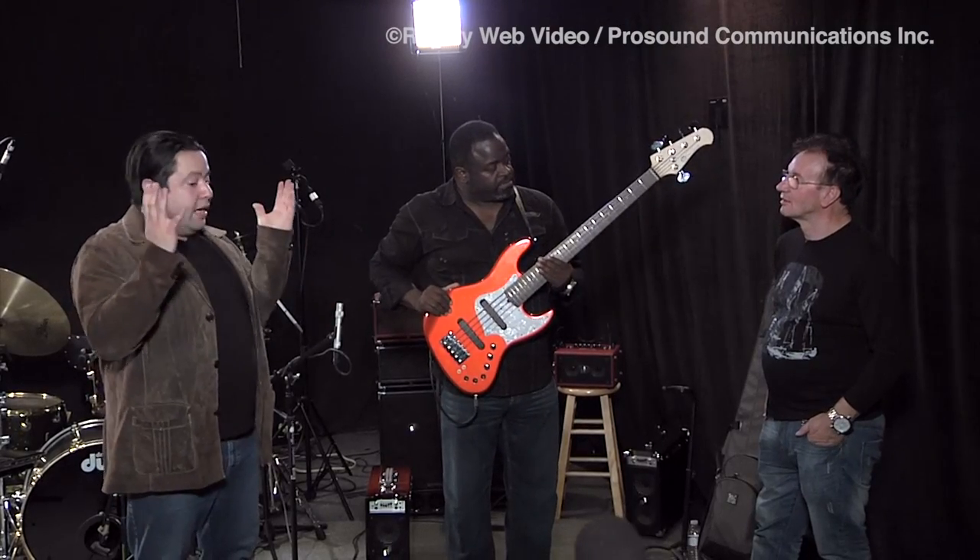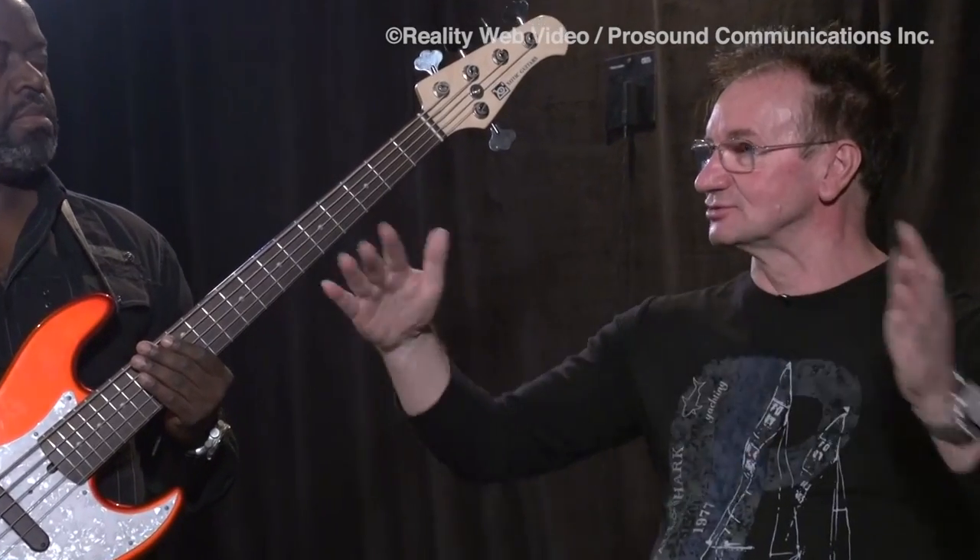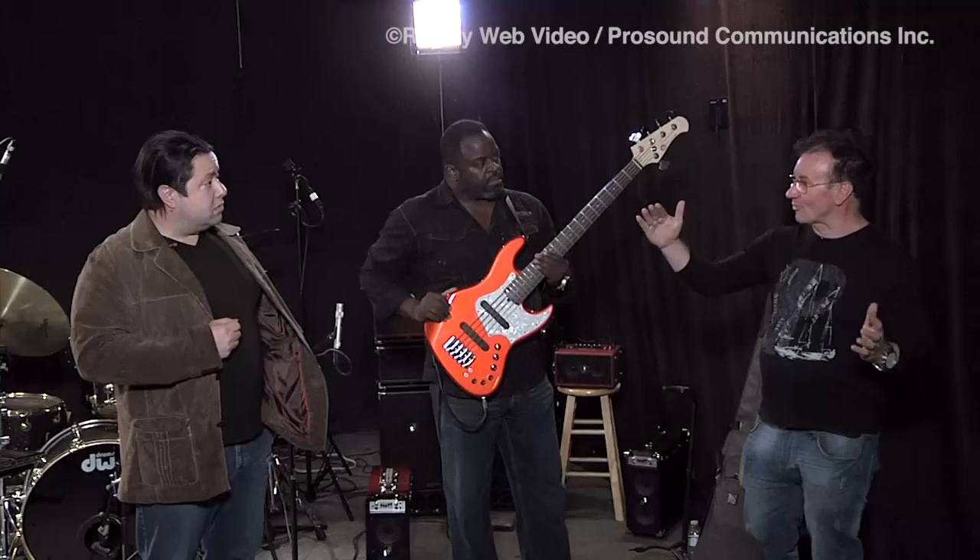The single five-inch driver seems to cover the entire spectrum of this bass — no matter where he's going with the low B, or thumping and plucking on the G-string, it's taking the full spectrum of the instrument and reproducing it. Well, that's because when you've got a small cone, it responds faster. Think of it like a school of fish — thousands of fish in the ocean can move on a dime. A whale, like a big speaker, is ponderous and slow. When you've got multiple small drivers, it's instant — it's following exactly what the player does. And you don't lose any of the bass, because you've got the same cone area as a large driver, but they're all working together.